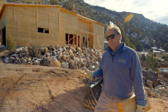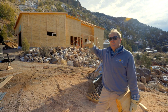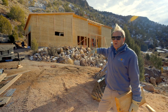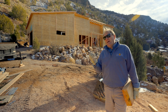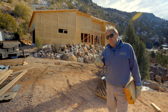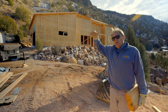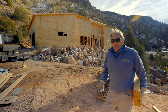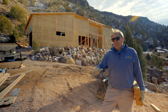And give you a couple of other things I decided to do on this job. If you see, I've got a soffit here, and I'm actually covering my soffit, which is the underside of the eave, basically. That's your soffit. The fascia is the part facing you, the soffit is the underbelly. I'm covering that with some sheeting because I typically love to do aluminum soffit and fascia, but I may not do that on this home because of the look and the design. I may just do stucco all the way up and around and on the bottom of that. So my framer didn't like that. It's more work for him, but I smiled and gave him some chocolate. And he says, okay, we'll do it. So again, framers are your best friend.